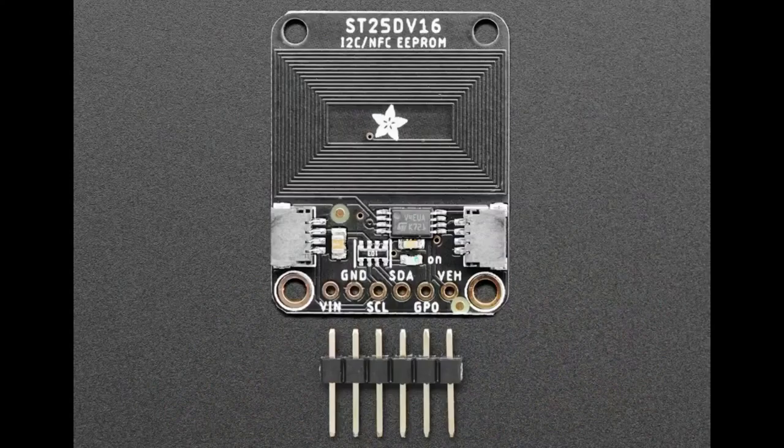This — which is the breakout we have — is interesting because it has a coil antenna built into the circuit board. You can, of course, use an external antenna, but it's convenient and inexpensive to have it printed onto the PCB. Over I2C, you can communicate to it, so you can read or write data over I2C or through RFID. That gives it a dynamic ability to act as a bridge between NFC communication and microcontrollers that don't have NFC. It's quite rare for a microcontroller to have NFC built in, but this chip — which is very inexpensive — lets you bridge that data.